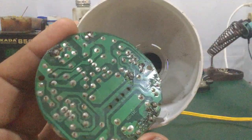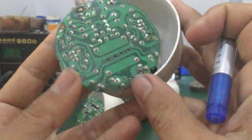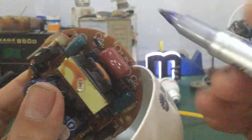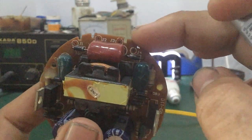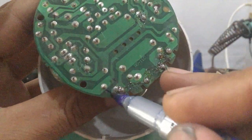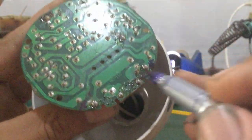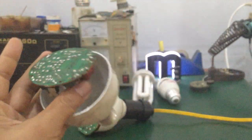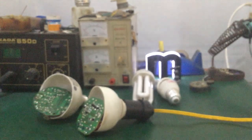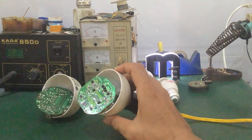If the ballast is working, then its choke output voltage should be present. In cases where you measure and there's no voltage or the voltage is missing, then the PCB board is faulty and you need to inspect and repair it. The two outer edge pins — pins C1 and C4 — measure those. Measure the AC voltage at pins 1 and 4, the two outermost pins.